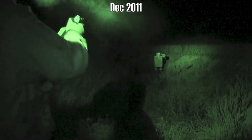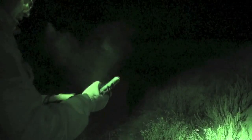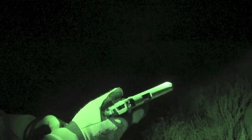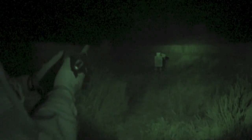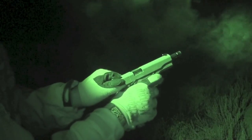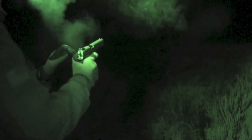When it was failing to feed and jamming repeatedly on multiple outings, this thing has 7 outings under its belt, I said, you know what, I think I'm just going to take it back to the shop myself. I'm going to take the gun apart, Flitz the crap out of the slide rails, buff them, and get it nice and smooth, just like I did with the CZ P07 Duty. If you watch that review, that's what I did with that one. And I think it would have helped. But honestly, it's really not my problem out of the box. And it's not your problem either. It's the manufacturer's. And the gun does have a lifetime warranty. Take advantage of it, albeit sending it in is a hassle and it costs money, ain't gonna lie.